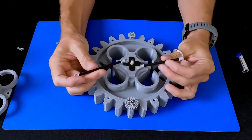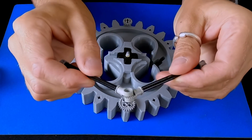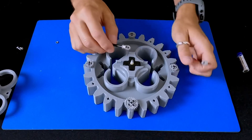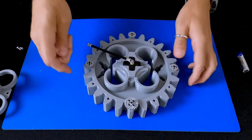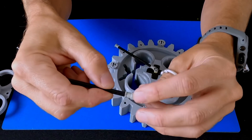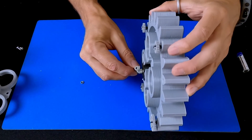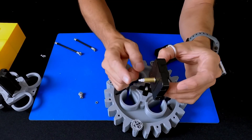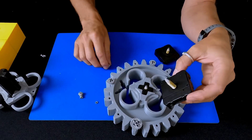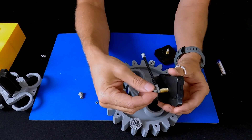To make the clock hands out of Lego Technic axles with these Technic knuckle joiners here as the support arms. But it is a little tricky. The problem is that if I push this one onto here, which does fit really nicely, I could get the next one on by gluing this knurled nut into the back of there and then screwing it onto the minute hand. But they won't pass each other — they're going to interfere with each other. I've got this longer mechanism here with a really long spindle on this clock interface, so I'm going to try this.